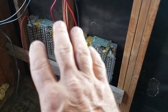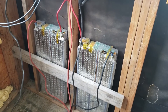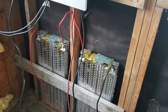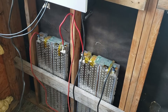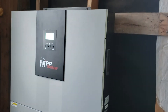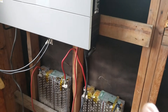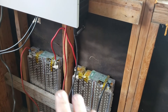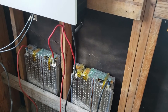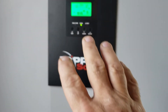As I said before, the Tesla batteries are not really what you would want with one of these inverters, just being honest. The voltage ranges on them are just not what meets with a lot of your inverters and charge controllers out there — it's a little off from the ranges they normally go with. But nonetheless, there are enough setting variants in this unit that you can use them.